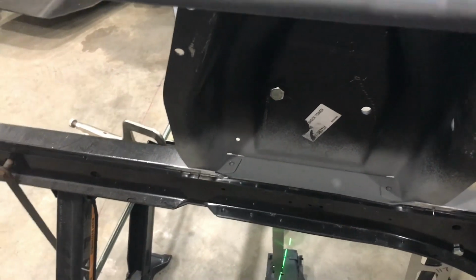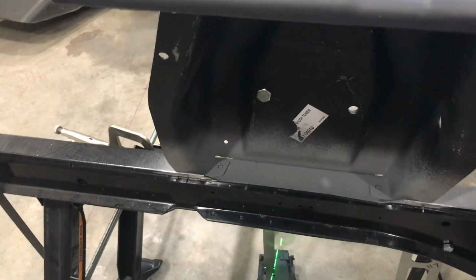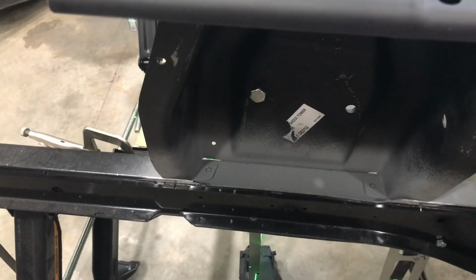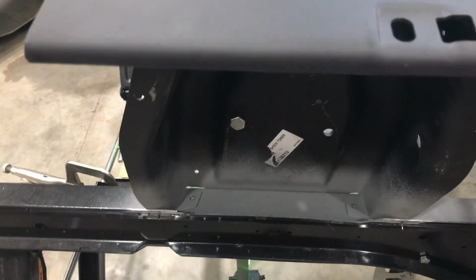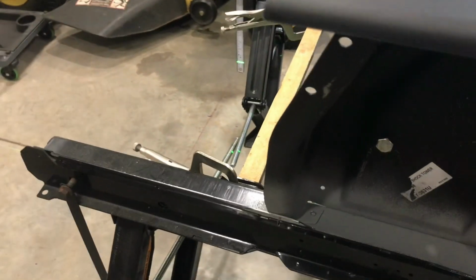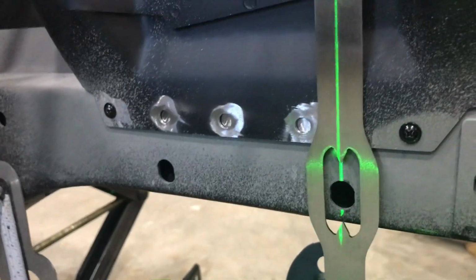I mean, some of them were held down much harder than they should have been, but it seemed like it was kind of a hodgepodge of welding. I am going to be putting the plates in there in the bottom to go across to beef up the bottom and kind of triangulate that. The beef up plates that run through this area, I'm going to install those later and tie that in, and then I may also run a little bead along these edges here as well. Then on this side over here I'm going to do the spots, but then I'm probably going to put some stitches along the bottom. I may even weld it in solid.